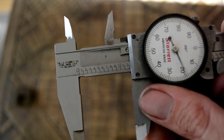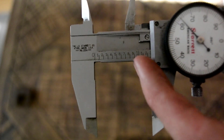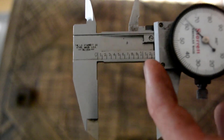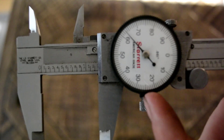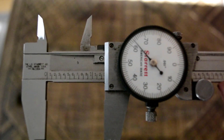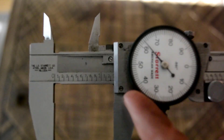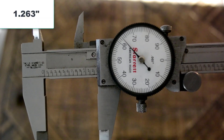Let's do another one, getting into the inch. You look at this side first — we know we're past an inch; that's one inch, and you see the numbers start over: 100, 200. We're not at 300 yet, so we come over to our dial and see that we're at 60, count the marks, and it looks like it's three past. So we say this is one inch, 263 thou.